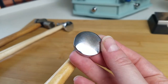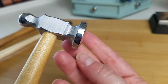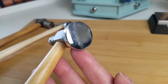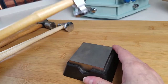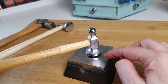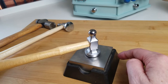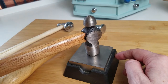What makes this unique on this particular hammer is — if you look closely — this planishing face has a convex domed surface, not a flat surface. One way to tell if your chasing hammer has a domed surface is to rest the head of your hammer right on your bench block. Notice that gap around the edge — that tells you it has a nice domed surface.